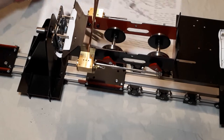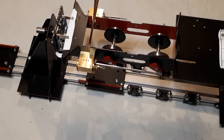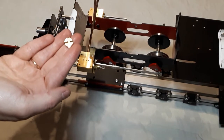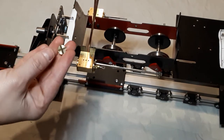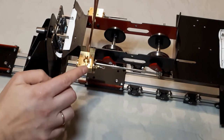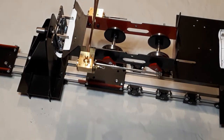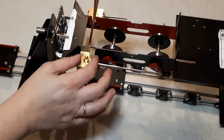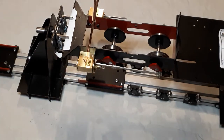So I've got my instructions here, and it says place the slide valve on top of the cylinder block. So these pieces here are the slide valves, and they're going to sit on top of your cylinder blocks. Now, this is where a build frame comes in handy, because you can have this sitting level and flat, so it doesn't slide about on top of it everywhere for you.